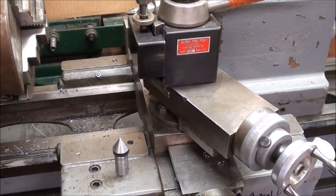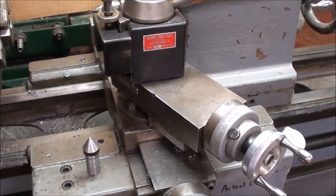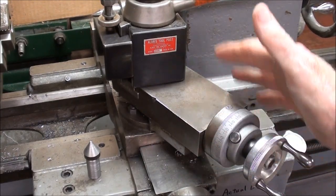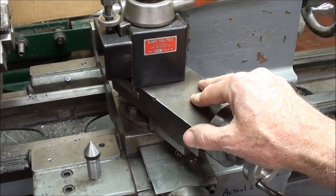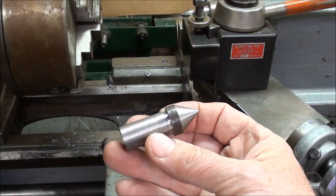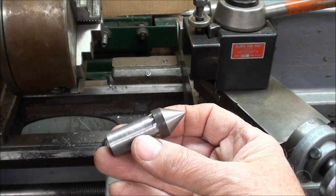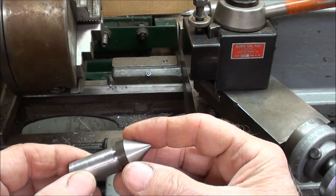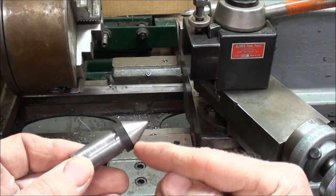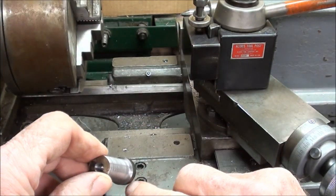Now here's an alternative way of setting this up for multiple threads — for even numbers, two or four start — and that's with the compound back at twenty-nine degrees. In just a minute I'm going to tell you why this is more advantageous than a plunge cut. But you need to make yourself a center. This can be made of soft steel, and the dimensions will vary depending on your chucks and machine. I've taken three-quarter inch soft steel, about two inches long, and turned a sixty-degree taper on it by the compound rest method.